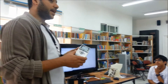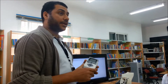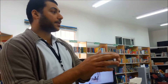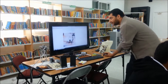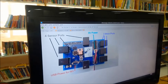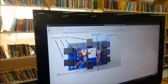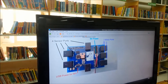Dexter Industries created a simple board that performs as a brain. You can connect your motors to ports A, B, and C, and you can connect some sensors to ports 1, 2, 3, and 4. So some ports for motors and some ports for sensors. Looking closer at the BrickPi: it has 4 sensor ports, a 9-volt power connection so you can use a 9-volt battery, USB power for the Raspberry Pi, and 3 motor ports. You can use EV3 or NXT motors.